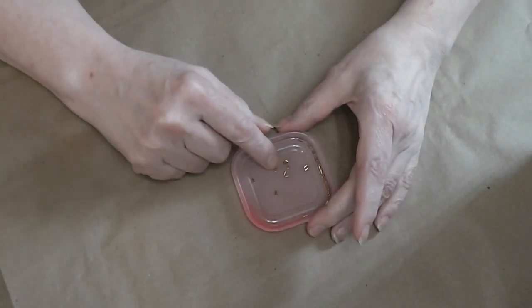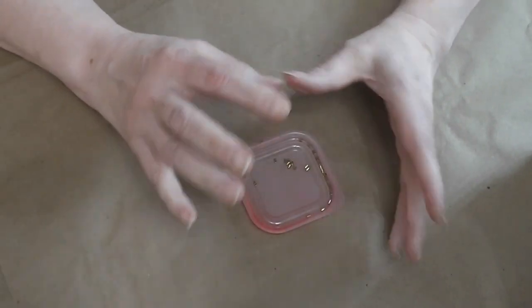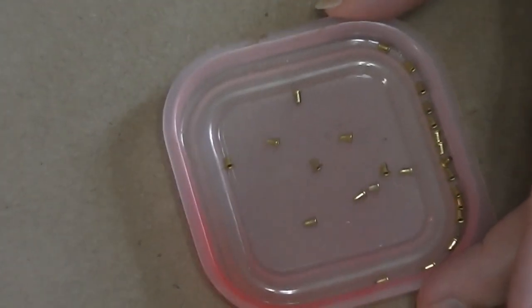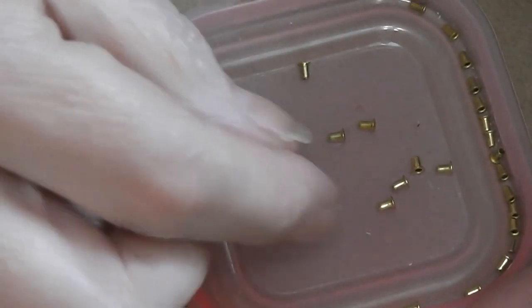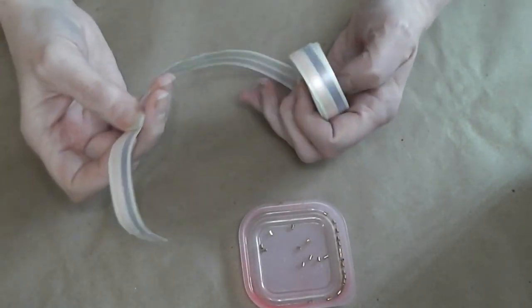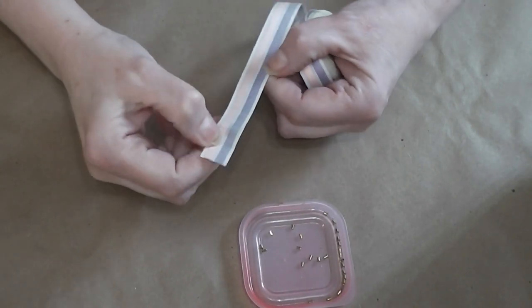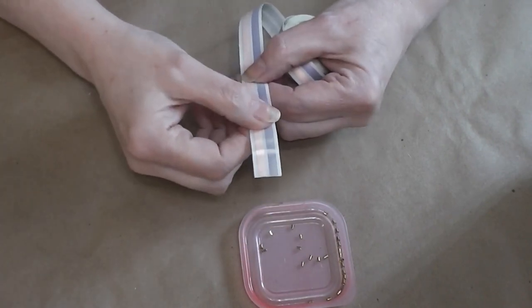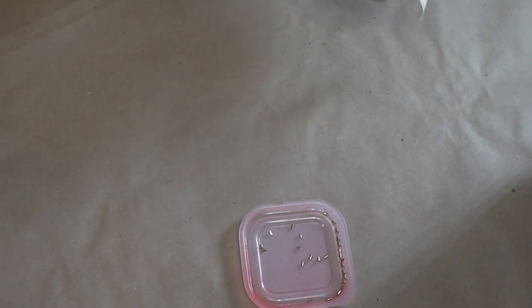You need either brads or eyelets — also called grommets, depending on who you're talking to. They are very tiny, but these are what we're going to use to splice our wire together. Whenever we join two pieces of tape wire — when we make corners, go from the first floor to the second floor — we have to do what's called a splice. That's what these are for: they make the connection between one strip of tape wire and the next.